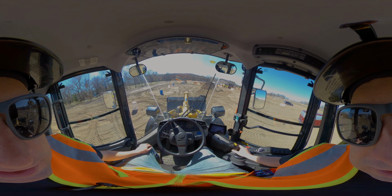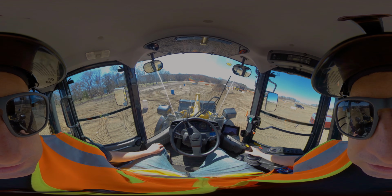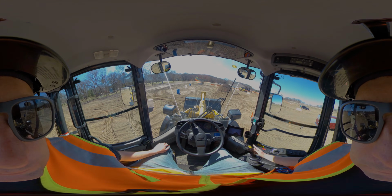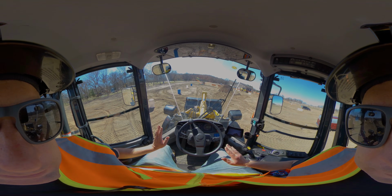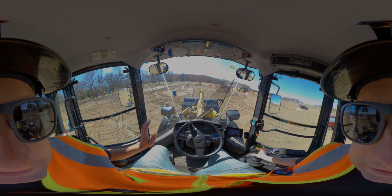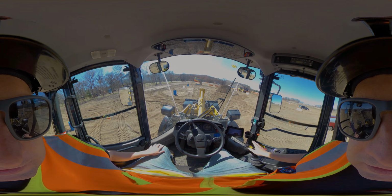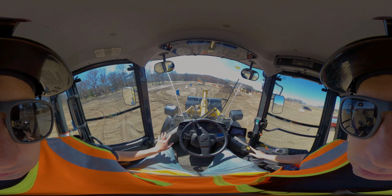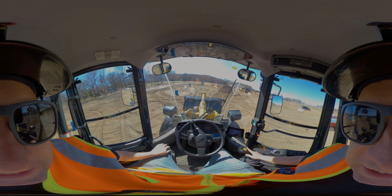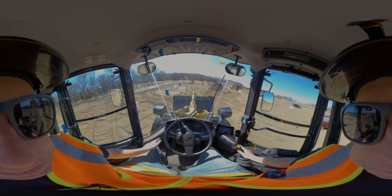Well, before we go in, you'll see we're going to flatten it out. And this is kind of what our scooping, our loading position is going to be. Now, a lot of operators, just for efficiency, will return it and they'll just drive around like this, which again is perfectly acceptable. We just like people, if they don't train that way initially, sometimes they're driving around. If they got their bucket down at all and they drive into something, they can scoop in. So it's better when it's closed up, you're not running into any issues. It's just going to kind of roll up on it. It won't actually scoop in anything.